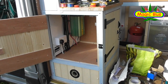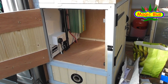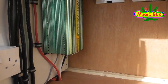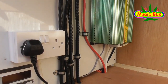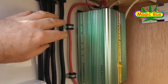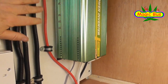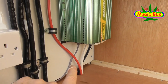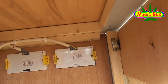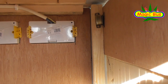That's another productive morning sorting out the electric box. I've now got 240 volt shore power, the inverter, and the 12 volt electric system in. That is now the plug for the battery charger, which is hidden away under there. These are the 12 volt wires — there are two wires in each black cover, so I've got eight 12 volt systems coming down out of the back of the battery box, where they'll connect up with the systems in the van. And of course this is the inverter — there we have the backs of the two plugs: one is the inverter plug and this one is shore power.